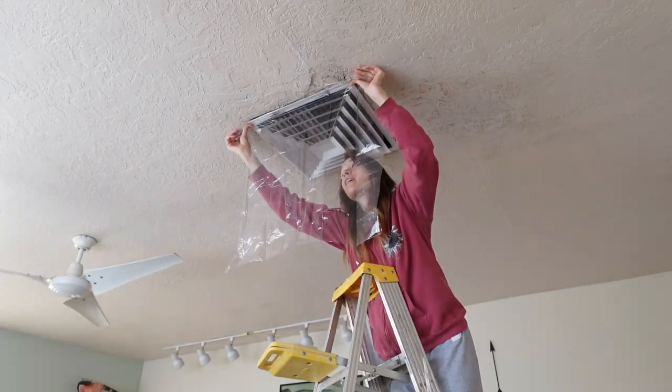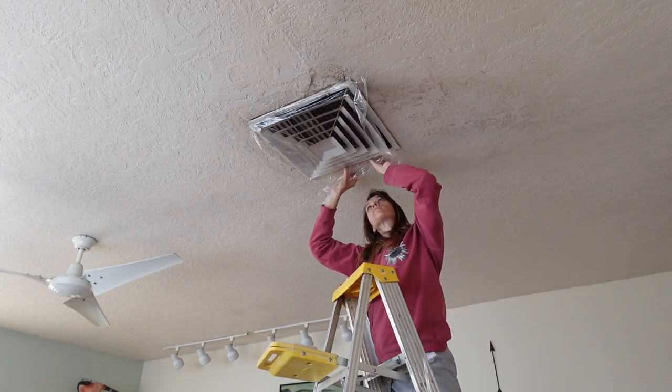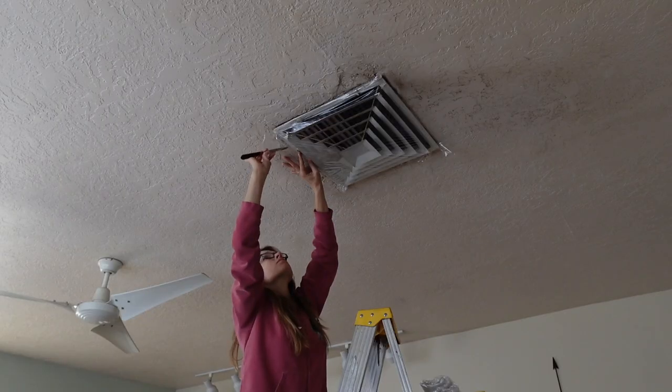So instead, I cover up the vents that lead into my house from the swamp cooler with one of those window shrink wrap kits. It's a little bit fussy — you have to get up on the ladder, use double stick tape, stick the plastic to the sides of the vent, and then use a hair dryer to make it all adhere and shrink up. I have three vents and I've covered all three of them up, so now it's time to get up on the roof.